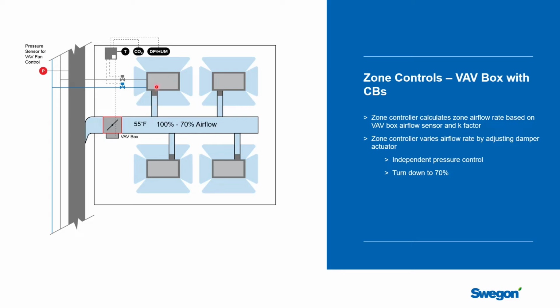The moment that you change the airflow going to that beam, it very quickly gets out of tolerance for the nozzle. And typically what happens here is if you reduce the airflow more than about 30% down from whatever the proper setting is, the induction process really starts to drop off, and you may not be able to actually induce any air to go through the coil.